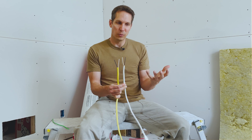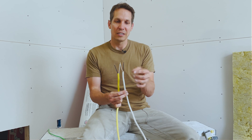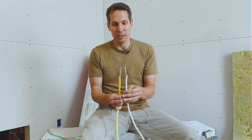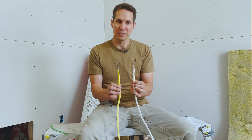You don't see three conductors very often, though 14-3 is used for things like three-way lights and smoke detectors. According to current code, all smoke detectors need to be connected to each other, so you'll usually have three conductors in the wire connecting them. That third conductor simply sends a signal — if there's a fire in one room, all the smoke detectors in the house will go off. The majority of your outlets and light switches are going to be 12-2 and 14-2.